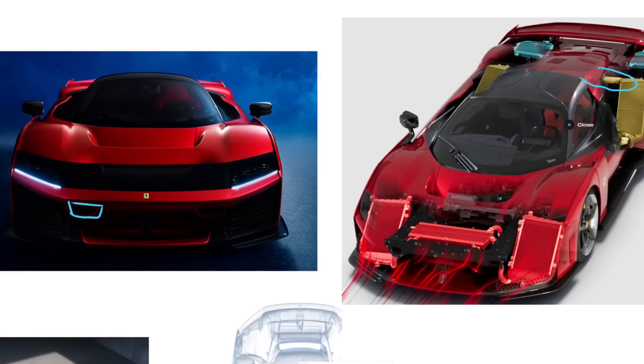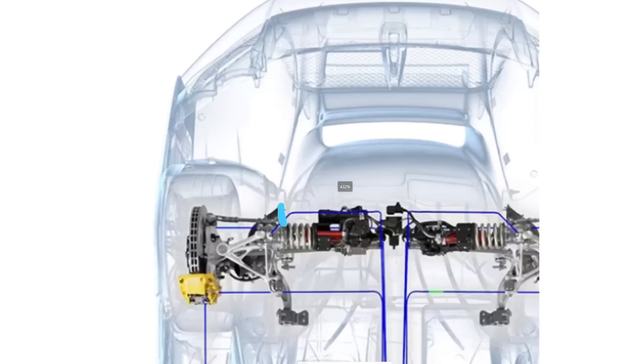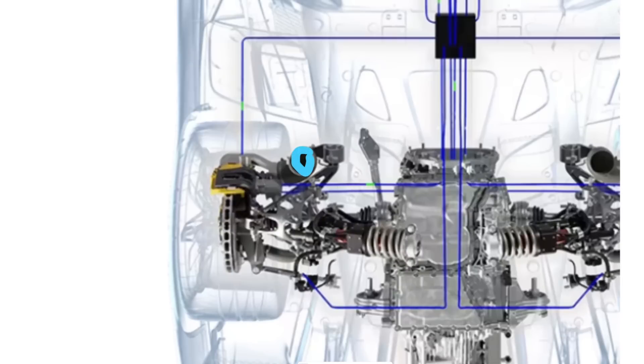There are also two little scoops here. If you look at where these are going, they look almost like they're going straight into the chassis rail. I saw in one press release that Ferrari mentioned the hollow chassis rails allow them to draw brake duct air from the chassis rail. Looking at the top-down view of the brakes, you can see the brake duct coming through just underneath the suspension, and it does look like it bolts roughly to where the chassis rail will be. So I think those front scoops are actually brake cooling scoops. Rearwards, a brake cooling duct takes air over the top and down into the brake, managed through internal flows.